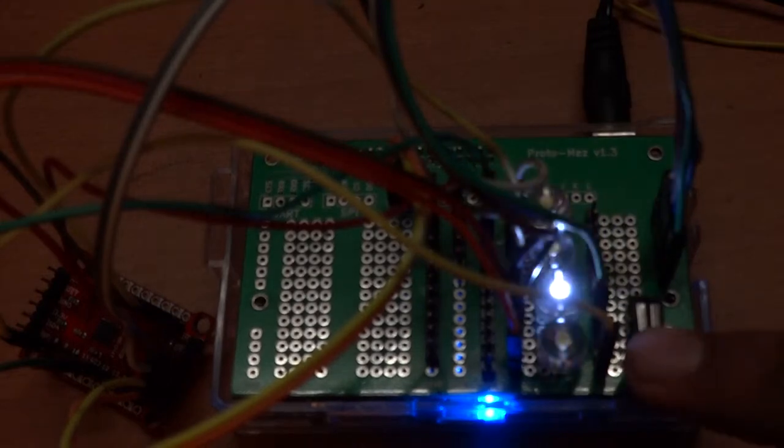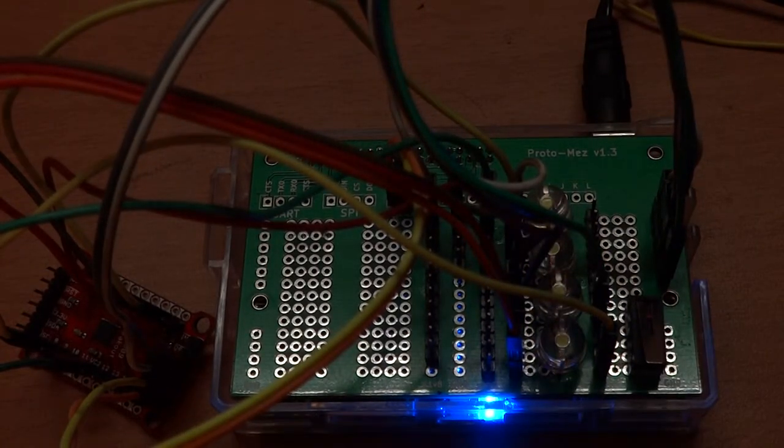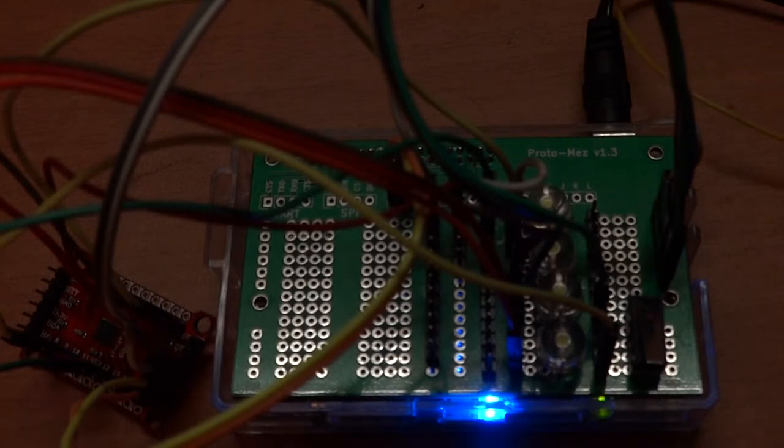So this was a small demo using the SX1509 GPIO expander on the Dragonboard 410C. I have the libraries linked down in the description. If you all want to go ahead and check that out, that's possible as well. The libraries are basically in the Arduino fashion, so digital write, digital read, and analog write are available.